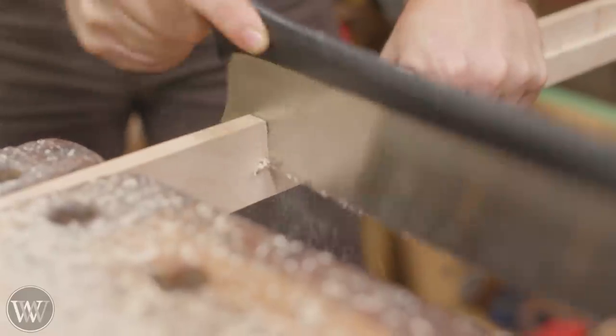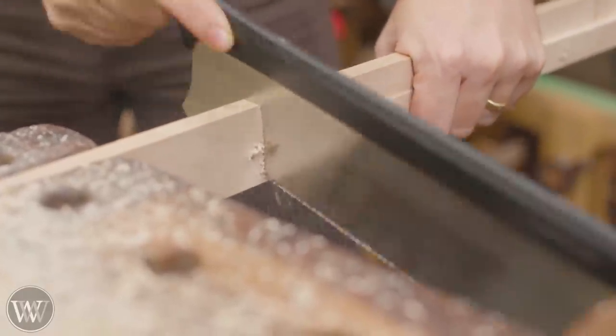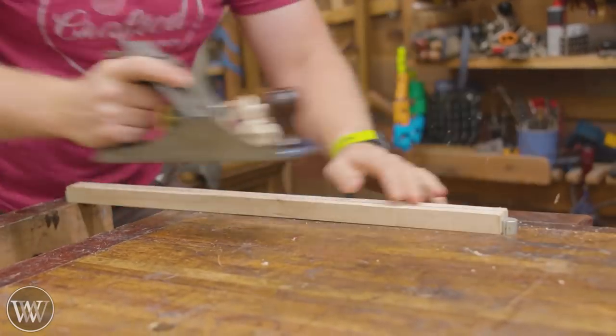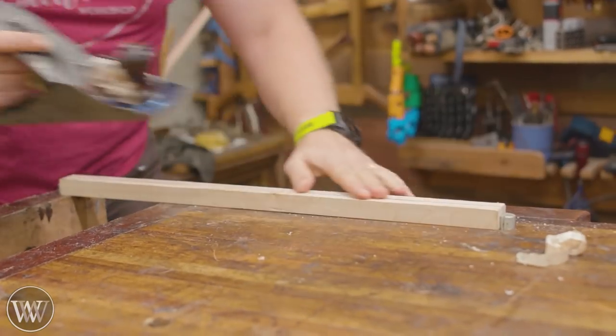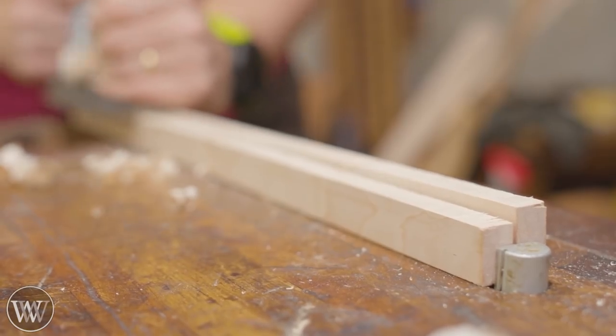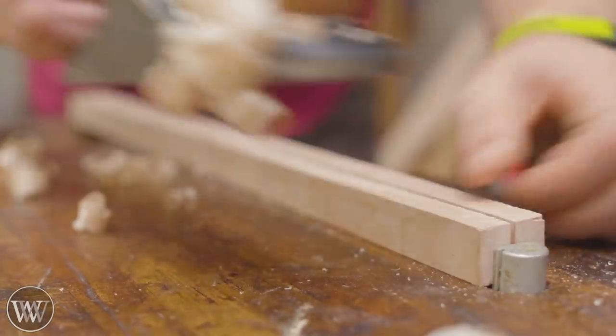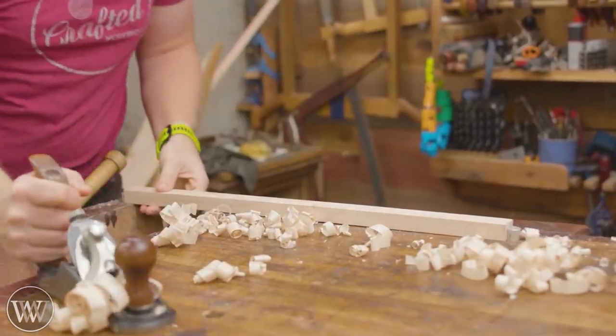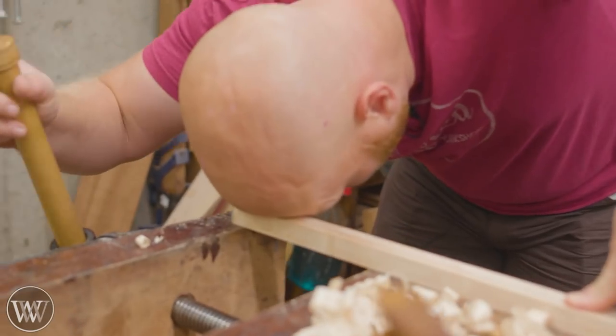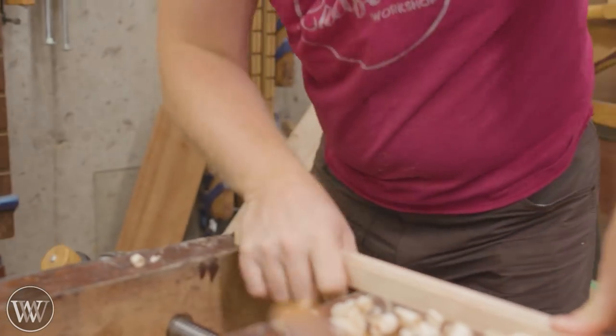So this will be just a simple test that I can then play with. We're going to rip it all the way down and then cross-cut it so I get two pieces, because I'm going to need 12 chunks out of this and because I'm experimenting, probably more. I'm going to put those up side by side in the end vise and that will allow me to plane them down and get them exactly the same thickness. It's very important that these be exactly the same thickness because they need to ride against each other.